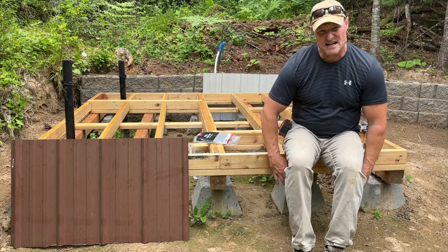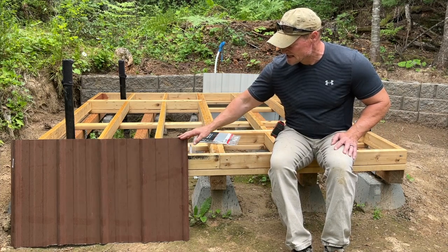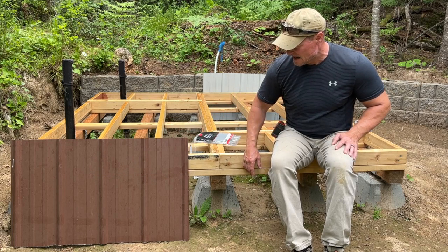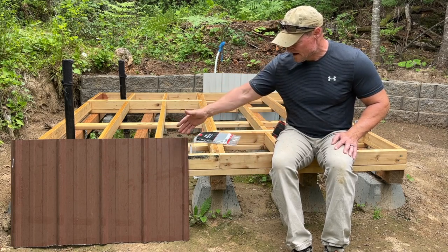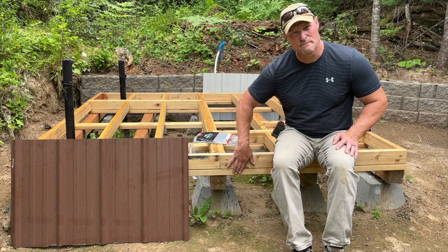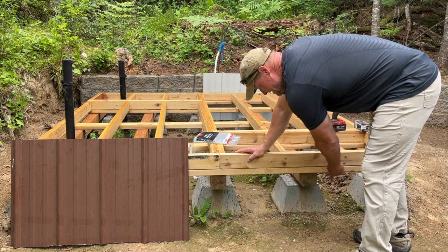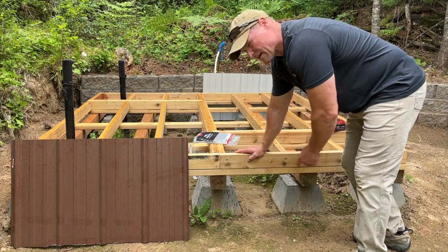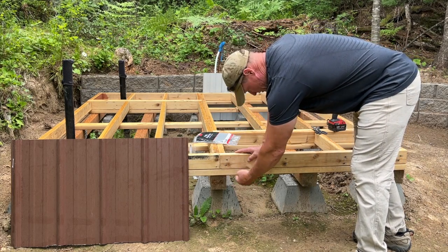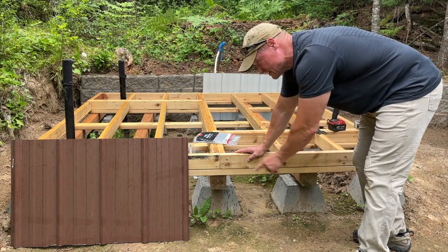See here, I've already discussed with you this huge gap I have on this side and that end over there. So I've got 6 pieces of my metal roofing. This is about 23 inches tall here and 38 inches wide. I have enough pieces to dig a trench. Once I see where my trim piece falls down here, I will go ahead and bury this subsurface. I'll use my hoe or whatever, just dig a trench. Drop that sheet metal right below that trim piece and screw it right into whatever wood's remaining. Maybe it's just going to be the butt ends of these 4x4s.